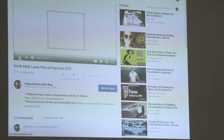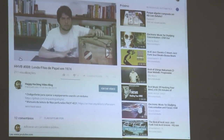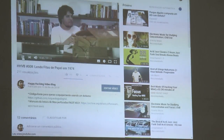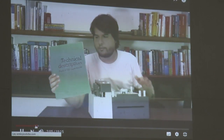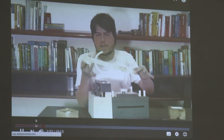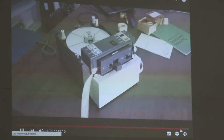There's a museum being set up at the University of São Paulo, and they found a box that was donated to them — it's basically a paper tape reader from 1974, from the same lab that developed the computer, and it was just hanging out there. I opened it and it came with a technical manual describing all the electrical signaling and protocol, and I was able to make it work with an Arduino to read the data.